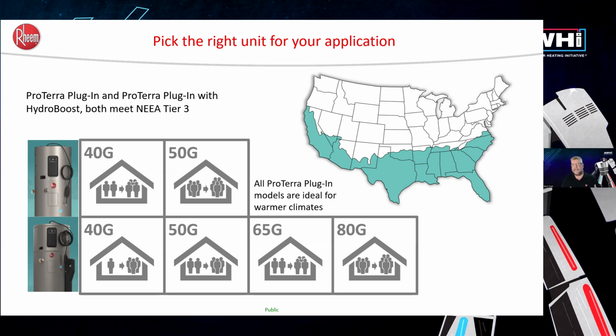If you really looked at the building stock of California for the past 20 plus years, builders have been required to put that single plug in over by where the water heater is located for that future tankless or future condensing gas product. We're going to use that with the smaller form factors for that dedicated circuit product. It will recover that tank. You saw Dan's recovery chart there. It will recover that tank in about an hour's time.